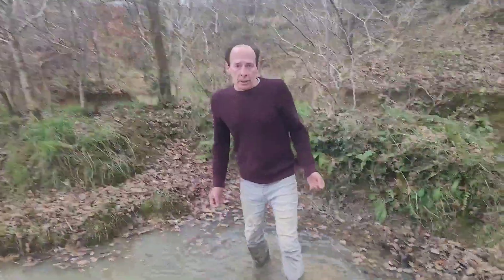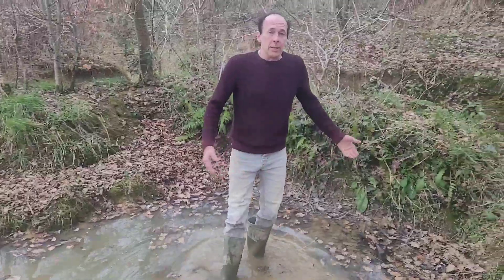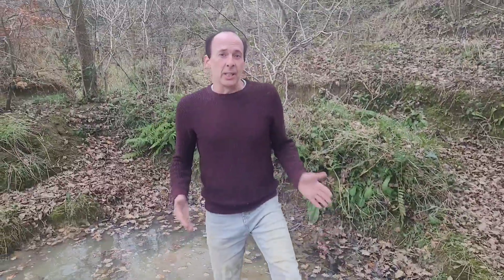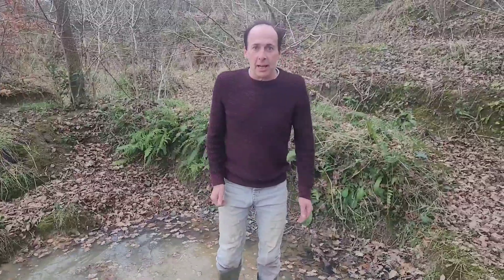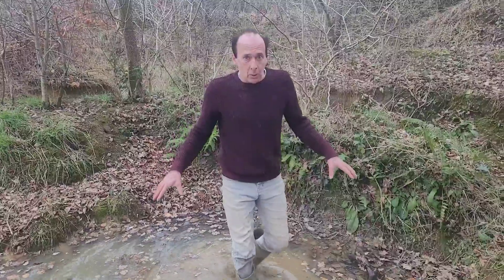One of the really good things about not having a liner is you can always change the shape of your pond or add a little bit — like we can add a little inlet. When you're making it, you can just bash the edges. He bashes the sides with the digger to compress the clay. But whether you do that or not, the eventual result is that it will hold water.